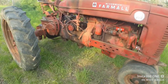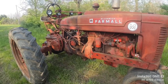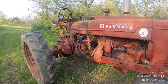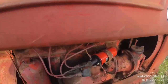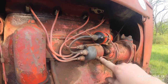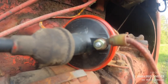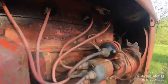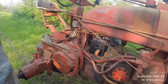So this tractor is 12-volt. But if you didn't know and you put a 6-volt battery in a 12-volt tractor, it's probably going to run. But if it's 6-volt and you put a 12-volt battery in it, you could damage some stuff. For polarity — whether it's positive or negative ground — look at the wire coming from the distributor and which post of the coil it goes to. On this one, that's the negative side, so we know this is negative ground because the points are the ground to the frame of the tractor.